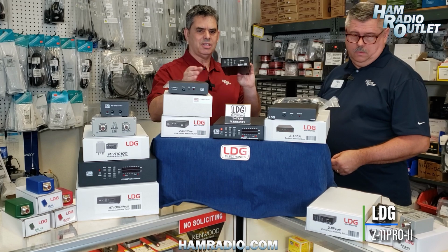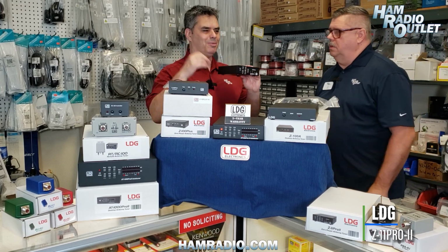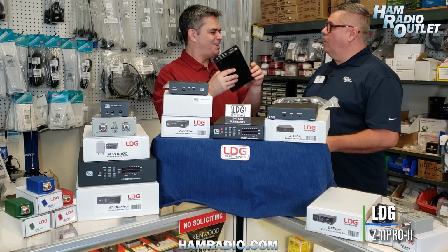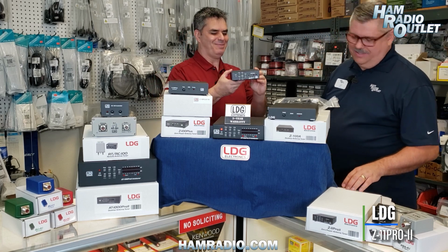Just remember, with most of these, digital, you're limited to about 30 watts. So don't do what I do and put 100 watts of FT8 through there by mistake. Did you let the smoke out? I let some smoke out, but it still works. It shows how strong these things are. Wow. Okay. So I turned it down again. All right. Nice.